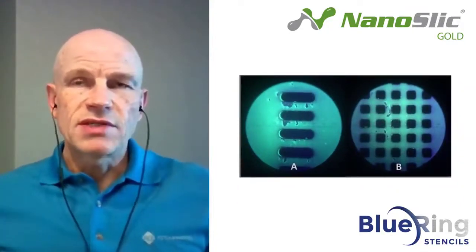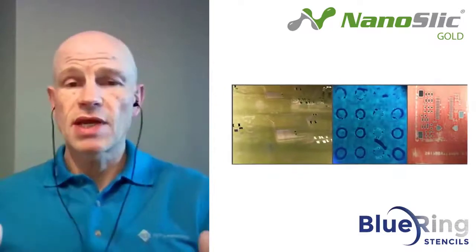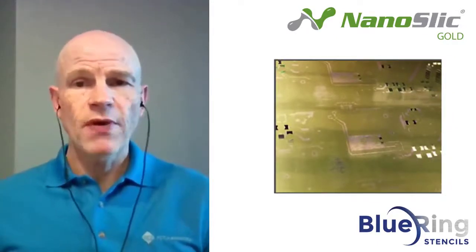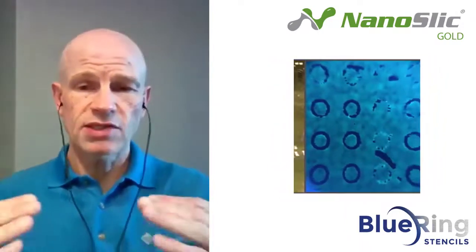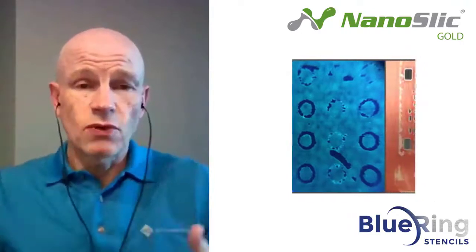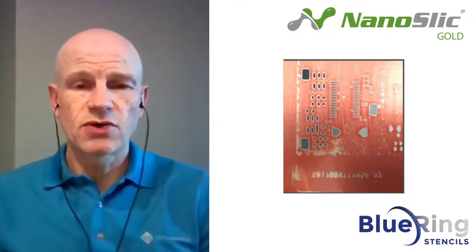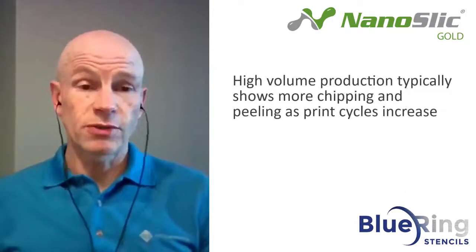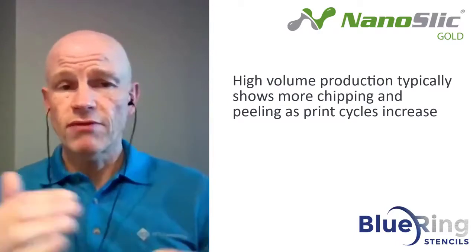And what typically happens is circuit boards have high spots on them. And we see wherever there's high spots, such as legend marking ink or thick copper weight circuitry, or the edges of the boards themselves, which are sharp, are pressing up into the stencil. And during the print process, imagine the circuit board pushing up into the stencil, sort of bending the stencil around the board. And then from the top side, the squeegee comes down and applies fairly high pressure to that stencil to print that solder paste cleanly, and it's bending the stencil even a little more across those high spots of the circuit board. And those are the spots where the coating begins to wear over a period of time, especially with high volume production. High volume production lines, you'll see coating wear around the perimeter of the circuit board and wherever there are high spots.